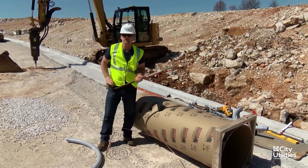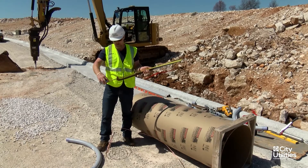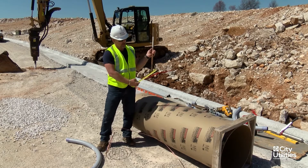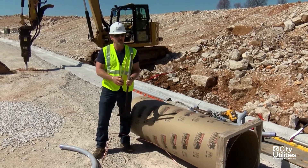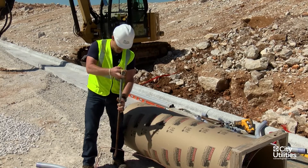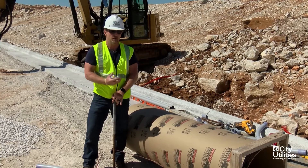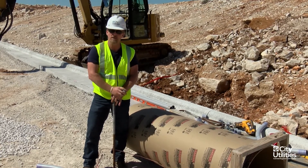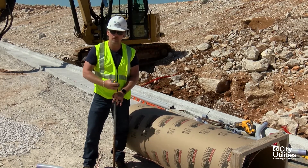Here we have a 36-inch, one-inch galvanized bolt that goes down inside — three foot long, 36 inches. It has a four-inch bend and also gets placed down inside the concrete and brought up to the top. Per our standard, four inches of this will be sticking above the concrete. Your standard or engineer may have called out two inches or three inches — it just depends on what type of pole or base is sitting on it, which will determine your bolt length sticking out of that level concrete.